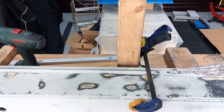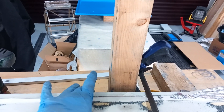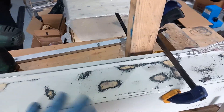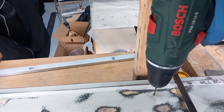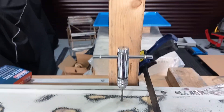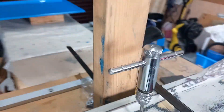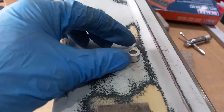I'm just going to drill the second hole, and I thought I'd show you how I managed to get it square - no special equipment required. Just make sure you've got something as a guide that's square to the bed there, clamped against the faces, and then it just gives you enough of a guide so that you can see whether you're square in both planes. Here I'm using again the piece of wood to make sure my tap is nice and square in both planes - simple visual references can be very very useful.